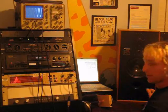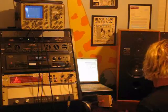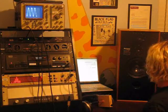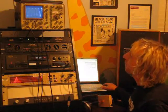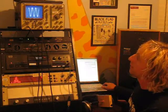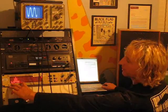Denons a shot. These Denons are interesting because even if I push on the shell, it doesn't change it much. And using a firm object, it doesn't alter the response. So the shell is rigid. We don't have a problem with that. Our level's good. I'm dropping down. We still have a pure sine wave. We're not seeing significant harmonics.